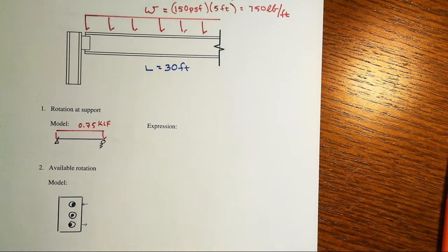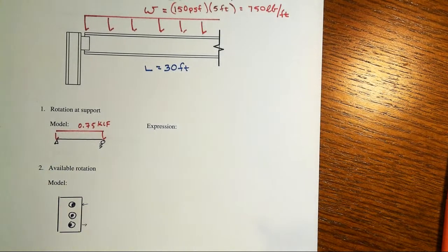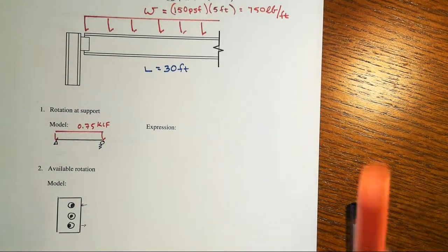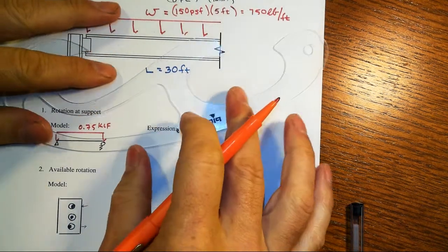There's a possible bending resistance just coming, or moment transfer through the connection detail. Is that a very significant value? And, well, what the heck? I mean, if this was really a single bolt, which would just be a pin, how much rotation would we get anyway, and how does that compare to what's capable of happening in this multi-bolt or multi-pin kind of arrangement?